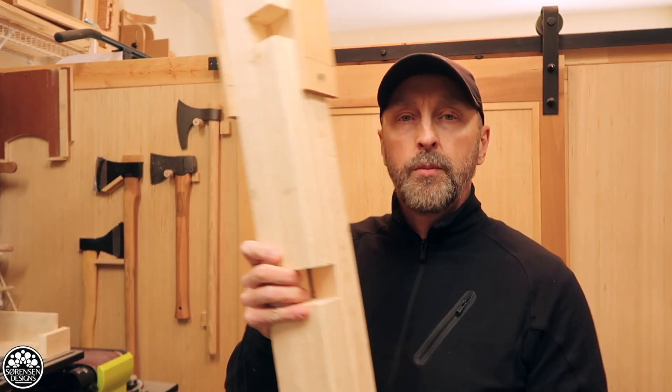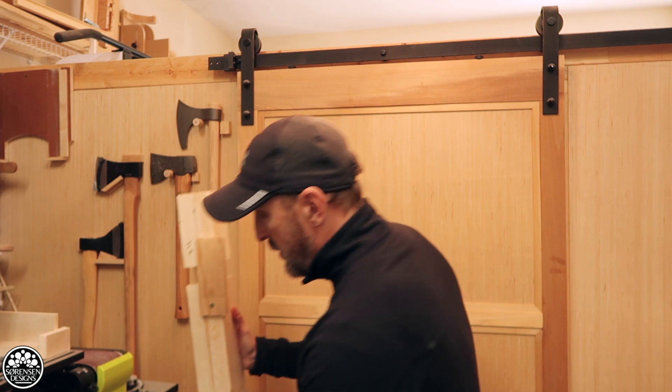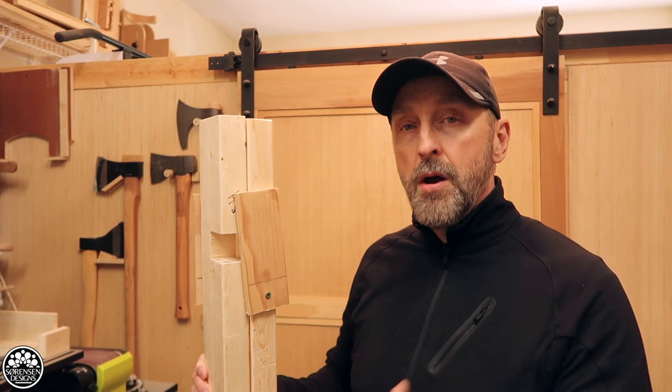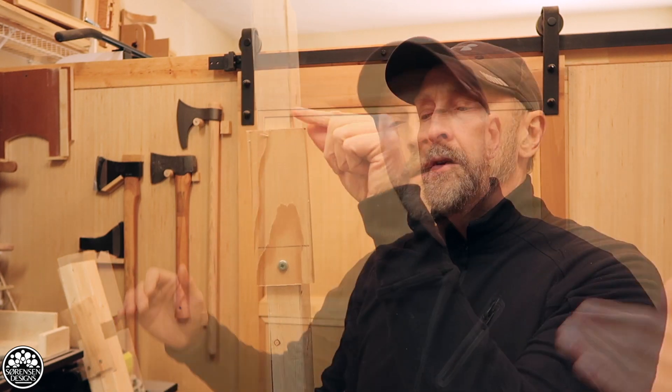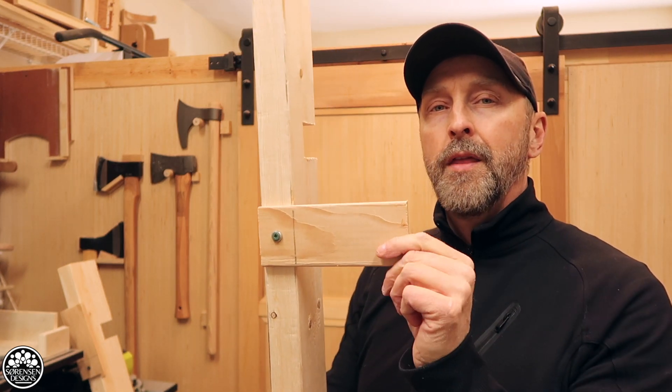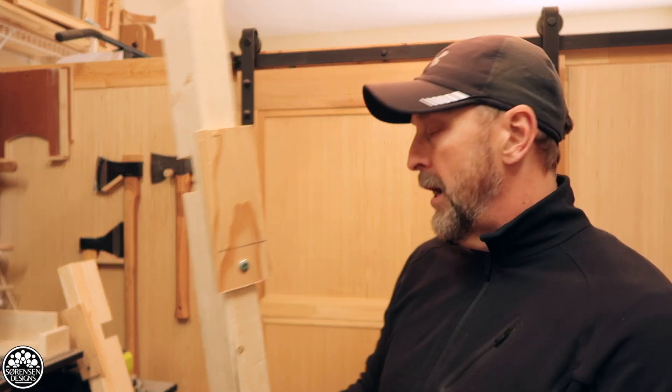Really that's it — just these two 2x4s. These are two five-foot 2x4s, and I've got four three-foot 2x4s. These don't take up much space in my workshop, and the saw horses fold away really nicely. I just store them back here with my lumber and they're out of the way. I made mine five feet but you can make yours longer, or wider if you need. You can make it four feet if you like. For me it's plenty big to break down a four-by-eight-foot sheet of plywood quite easily. The shoes on the bottom of the five-foot 2x4s worked out really well — it's just a piece of trim material attached with one single screw and a washer on top. I've seen other designs where they built special saw horses just for the cutting table, but that didn't make much sense to me — I wanted to use the folding saw horses I already had.